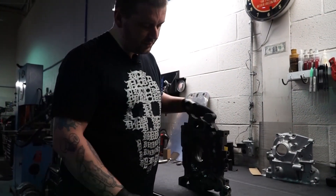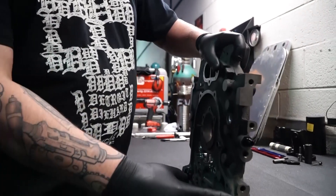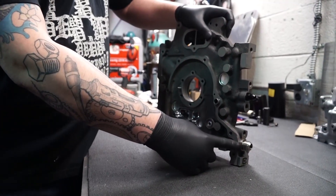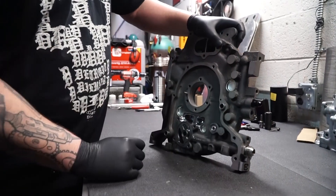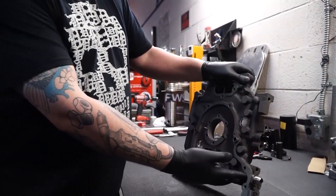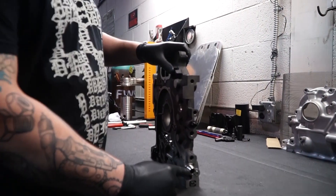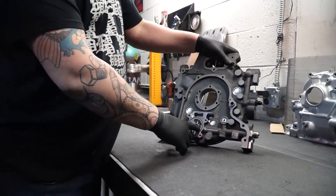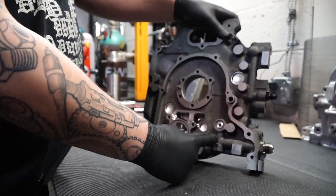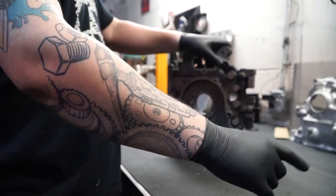On this one we also added the direct port outfitting — I make these in house. They're a dash-10 with three O-rings to seal the inside, bored out with three additional O-rings to seat and make it leak proof. In addition, the galley has been reamed out to 12.9 millimeters to match the diameter of the dash-10 port. So now we have a true dash-10 out from the pump directly, rather than having an undersized port going into a 90, then another 90, into the front cover, and out to the oil coolers.